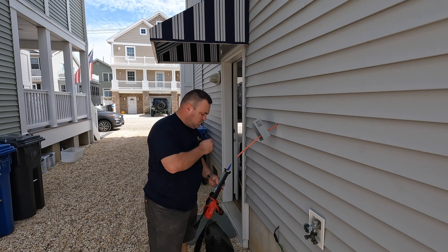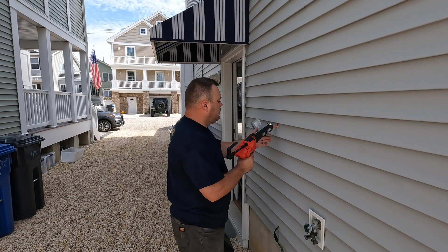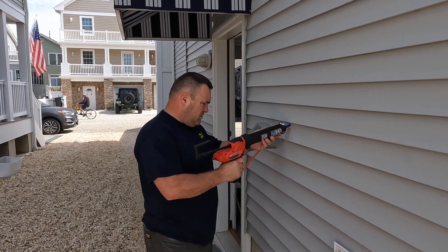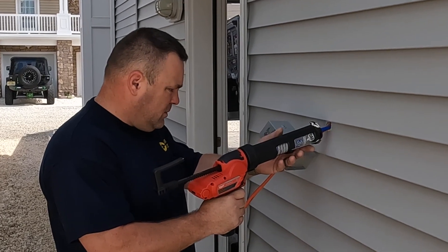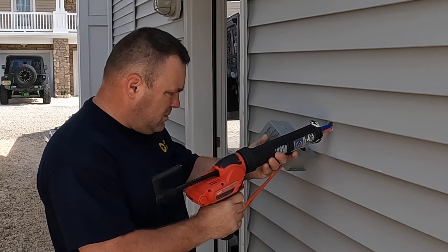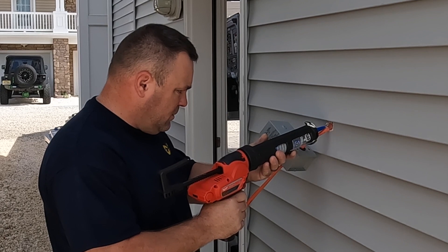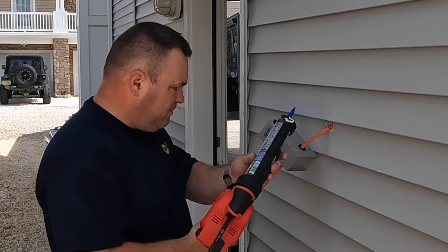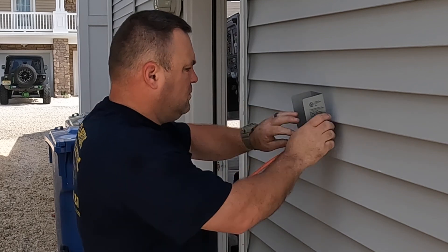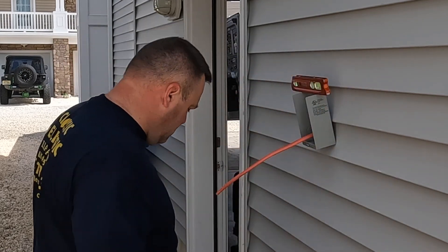The first thing you want to do is attach that four-wire feeder into the back of this inlet box. I'm using a Milwaukee caulk gun which mechanically moves the caulk to where you need it — it's a little expensive but works really well. I'm adding caulk to the back of this panel into that hole so air, water, and whatever doesn't get inside the house and more importantly doesn't get inside that panel where rust and condensation can form. That's the purpose of the caulk.